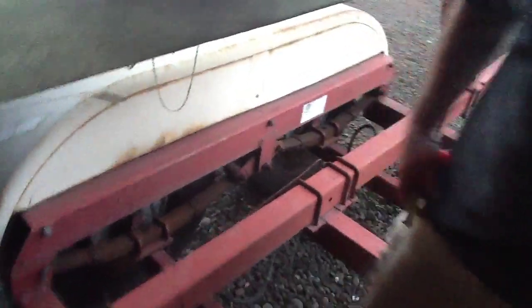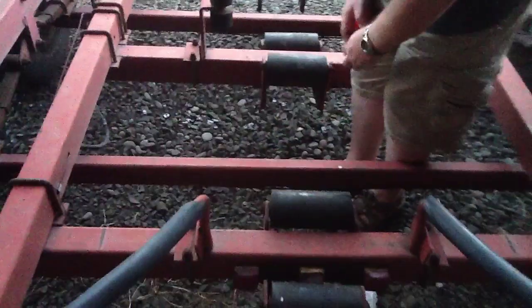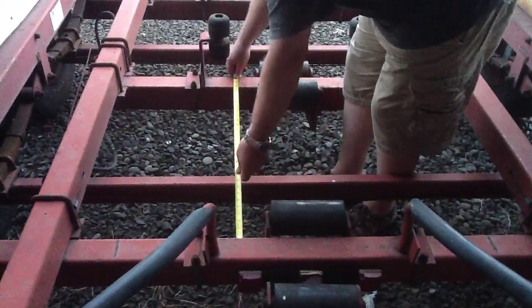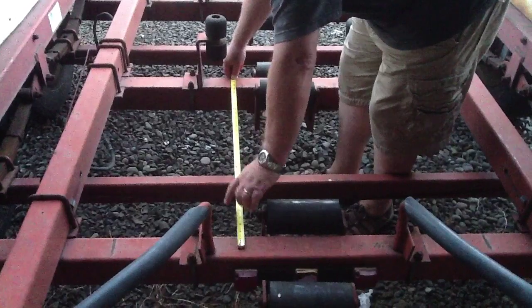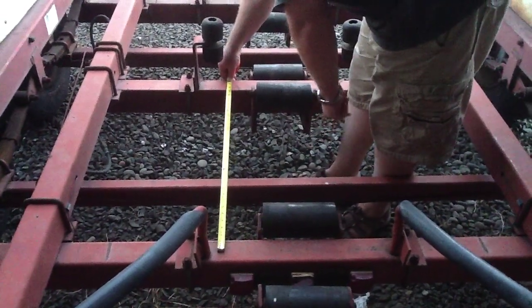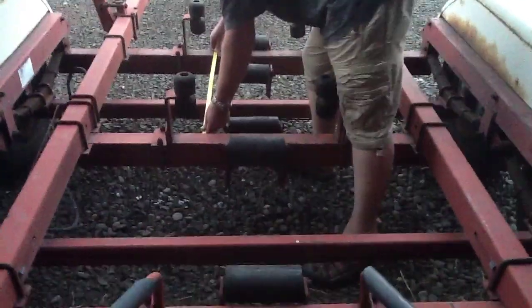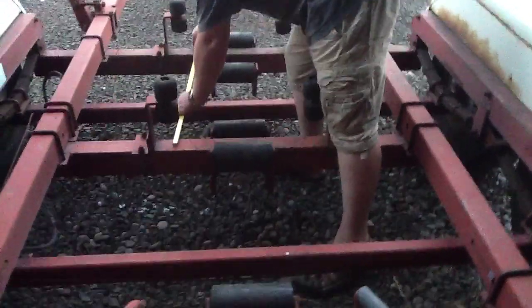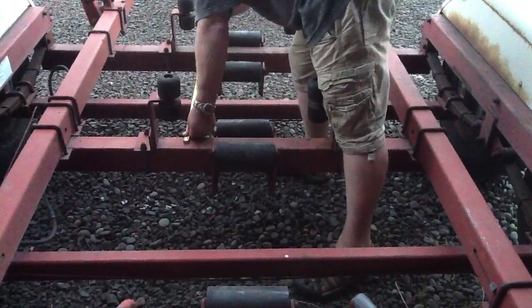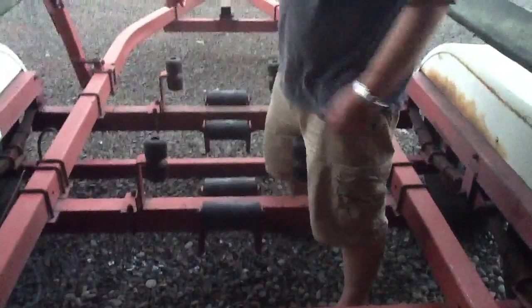That's 1/4-inch. Okay, so between this main beam and the middle main beam is 28 inches. Or if we go on center, it's about 30, well, it's about 30 3/4 on center. Same with that one? Here it's 27.5 or 30.5 on center. So they're not perfect. Looks like they spread them out enough to get their leaf springs in and make it work that way.